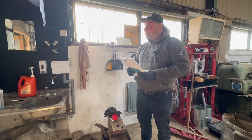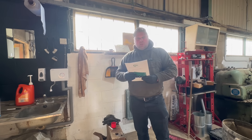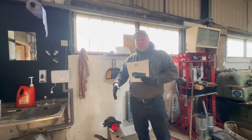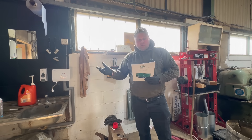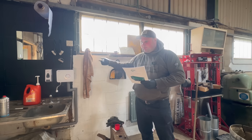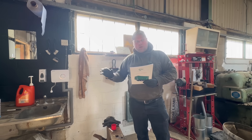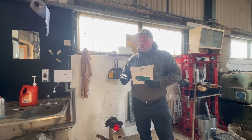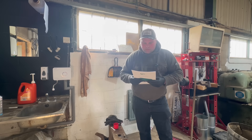First comment: 'it won't work' — well if you don't know, don't try. We've put tubes on the floor of the trailer. A lot of people have been saying put tubes down the side to increase the surface area. But because this is a gravity system, not a pressurized system, we're relying on gravity to pump the water round. If we put pipes up the side we might get air locks and that would stop the system from working. If it was a pressurized system we could probably do that.